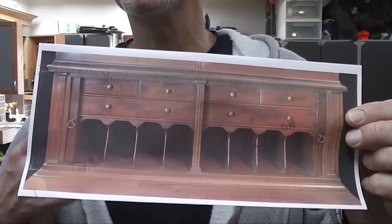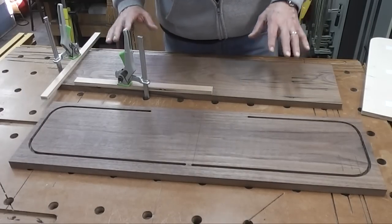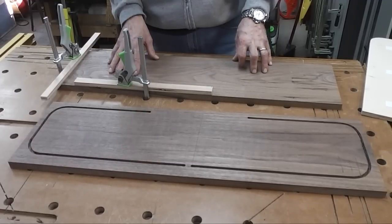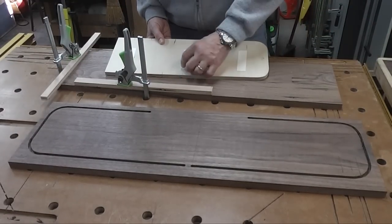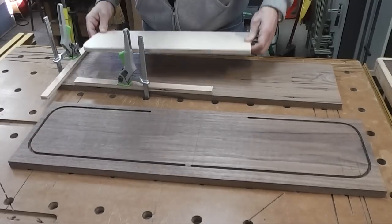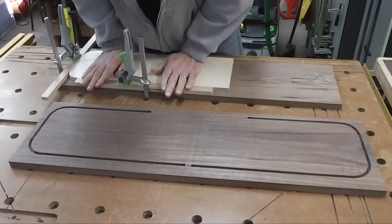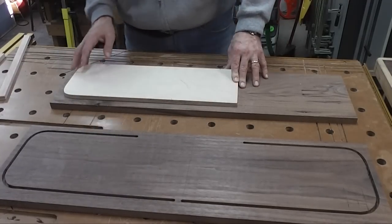As typical, I have some rough sketches and drawings of how I'm going to put this together — it's mostly going to be put together on the fly. So we're going to cut the bottom of the hutch and the subtop for the hutch. This is going to be the base, this is the front, and I've already done this one. You can see how the tambour is going to go around this groove. I've got the other piece here on my bench and these are some spacers. I've got a pattern I've made that I'm using to route with, and I just need to pull off some sticky tape. I'm making sure I keep the front with the front and the back with the back, because I need mirror images based on the wood grain I've selected. I'll press that in place and then I'll be able to take my router with the template bit and go around this piece.